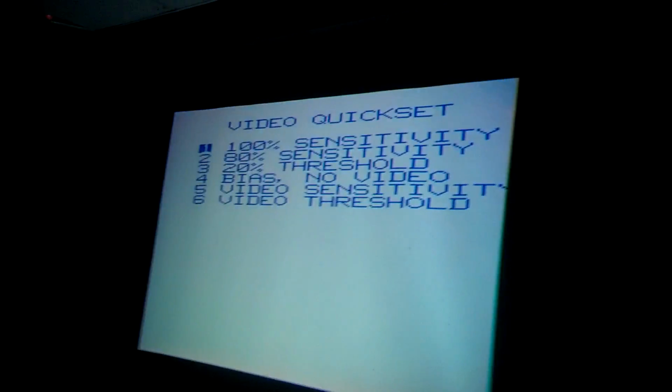And I pick option 1. Okay, and I cut off red and I cut off green, so it's just blue. And now when I hit the up arrow, the screen gets brighter and brighter. And if I hit down arrow, it gets dimmer and dimmer. But this time, the difference is I'm not changing the bias of the ILA. I'm actually adjusting the sensitivity offset of blue.